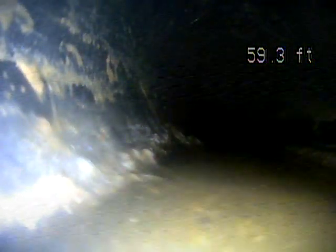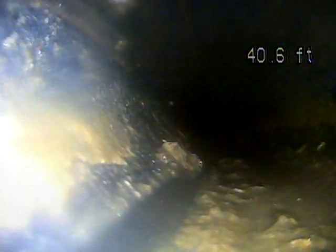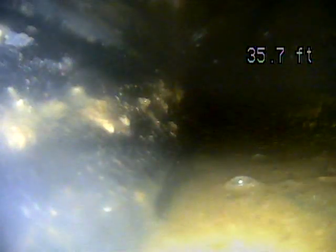I recommend having lines hydrojetted, as long as it's not cast iron — you don't want to hydrojet cast iron. When you hydrojet a line, it blasts out everything. When you cable or snake a line, it's just going to punch a hole through the blockage, which is useful if a line is backing up, but less useful if you're trying to further evaluate the line. You want to clean everything out and then have it re-cameraed to see what's going on and if it needs to be dug up to be fixed, or whether hydrojetting would solve the issue.